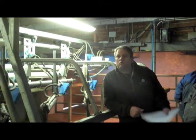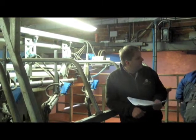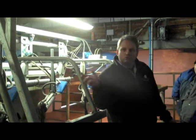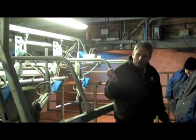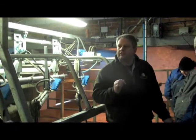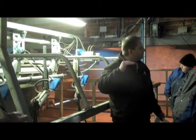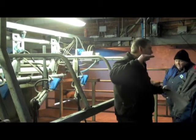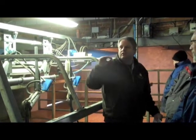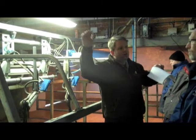Obviously time switches as well for your floodlights and the like. We've all done it — walked around the yard and a floodlight's been left on half the day. You can get dusk-to-dawn sensors which will stop the light coming on during the day. You can also get light level sensors, which are quite clever. They sense when there is enough natural light about and will dim the lights to correspond with the amount of natural light, so the overall light level stays the same but less is provided by electricity and more by the sun.